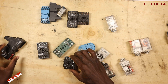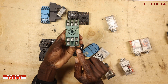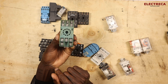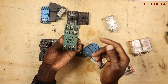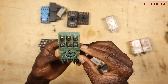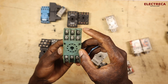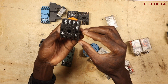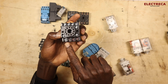So you can see the different types. If you look at this one, you have contacts 2 and 10 right here, and A1 and A2 are clearly marked. You have the common contacts, and then normally closed to common and normally open to common — clearly marked. In fact they've even printed 'normally open' and 'normally closed' right on the base. This other one also has number 2 and number 10 right here — those are for the coil.